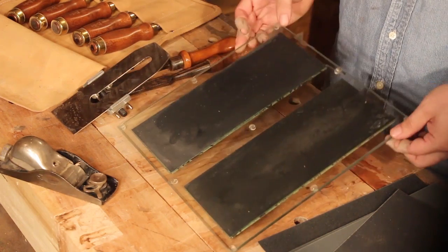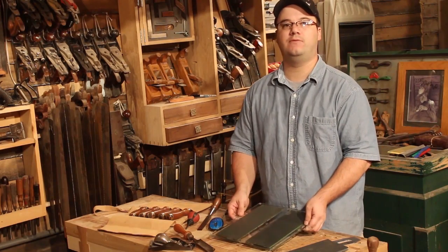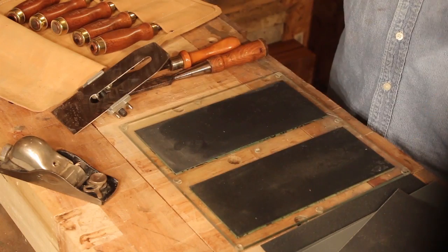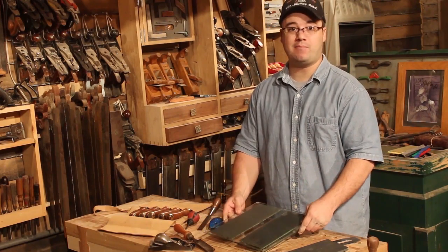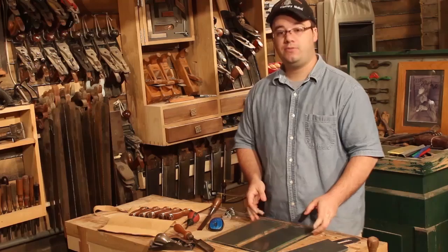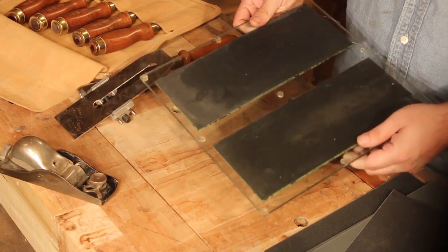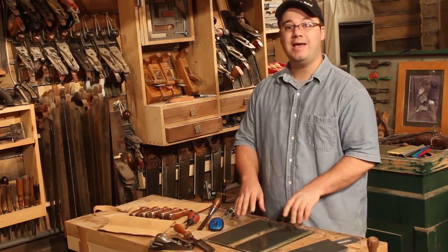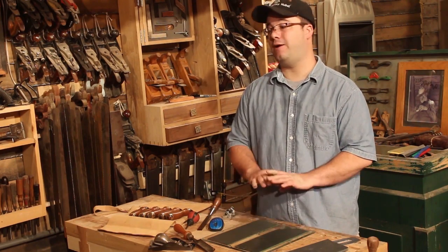What you stick them on is the key to the whole set, and it's a thick, heavy, ultra-flat piece of tempered glass. You can put all 4 grits on at the same time using both sides, so you don't wear out your paper backing by peeling it off and re-sticking it back on when you want to switch grits. There are little silicone feet that stick to the bottom of the plate glass to keep it from sliding around on your bench, and this thing is going to stay flat and clean up easy forever.